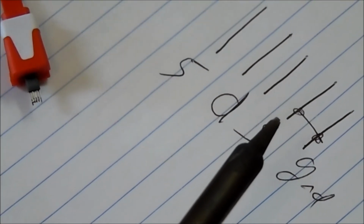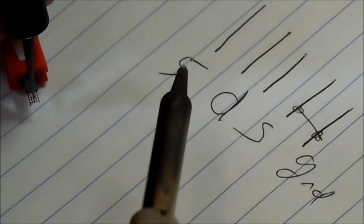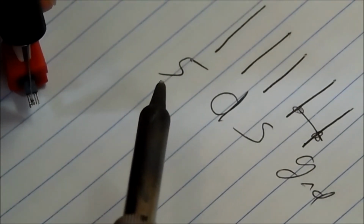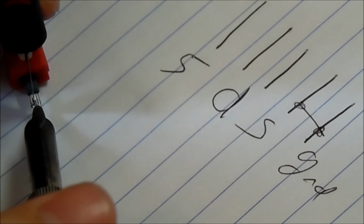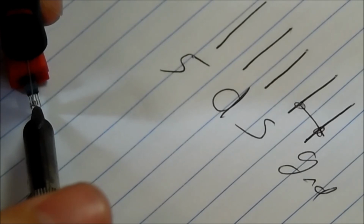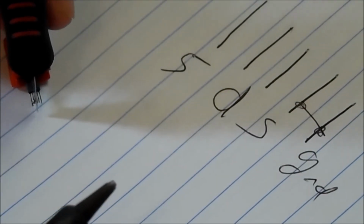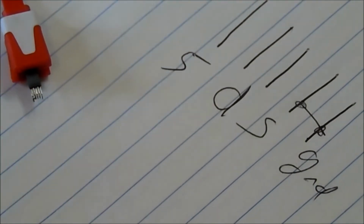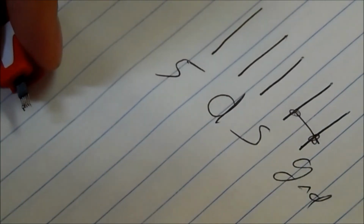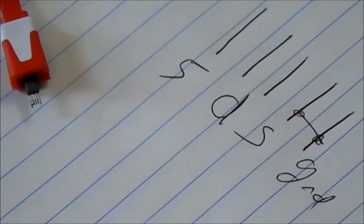Another way to do this is to get your utility knife and put it as a spacer for the pins you want to disconnect, and heat up the solder and push it through. So there. So you heat up the solder and you push the tip through, and it separates the solder, thus disconnecting the unwanted short. So, yep. So we do have the short we want, so that's good.